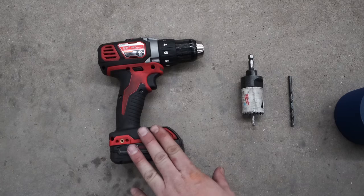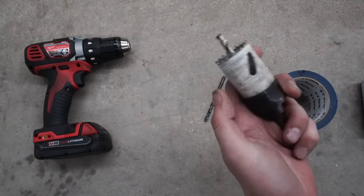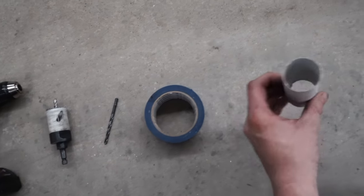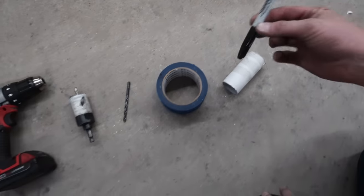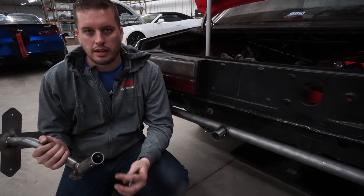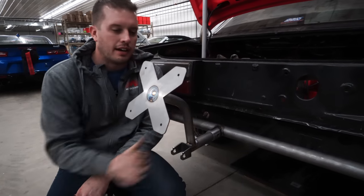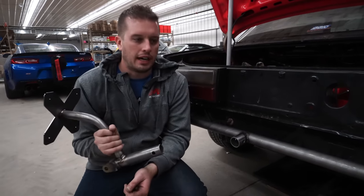What you'll need for this project: you're going to need a hand drill, a quarter inch bit or whatever your pilot bit is on your hole saw, and a one and a half inch hole saw — don't go any larger than that, as any hole saw is going to oversize. You'll also need some blue painter's tape, a toilet paper roll which is handy though not necessary, and a Sharpie for tracing. Our parachute mounts have an inch and a half receiver that goes into an inch and three quarter tube, eighth wall tubing, so you want that inch and a half hole saw.